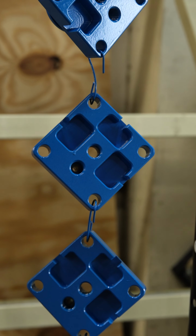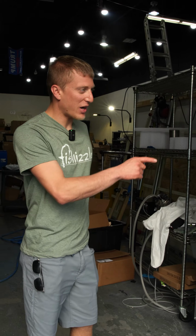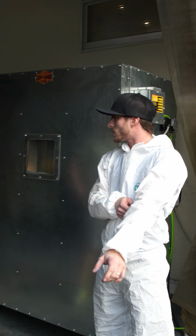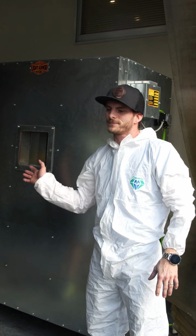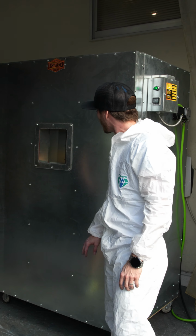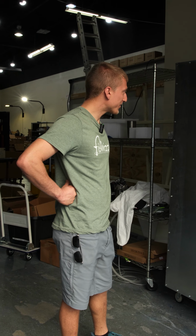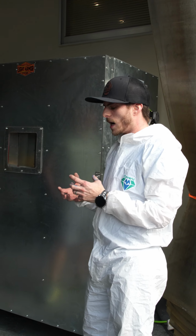Just that one? Yeah, we'll just do that one. Now, how long do you bake these for, and at what temperature? So we bake ours around 380 degrees for about 20 minutes. There's a fine spot between 350 and 400, but we don't need to get into all that. So about 20 minutes around 380 degrees. Nice. And these give us a really nice, thick, consistent coating.